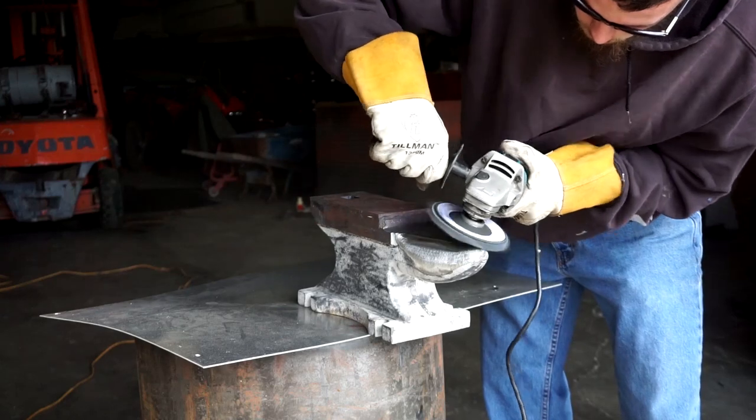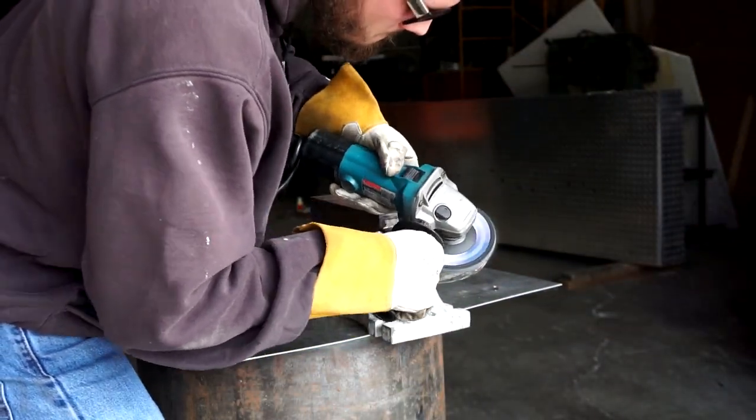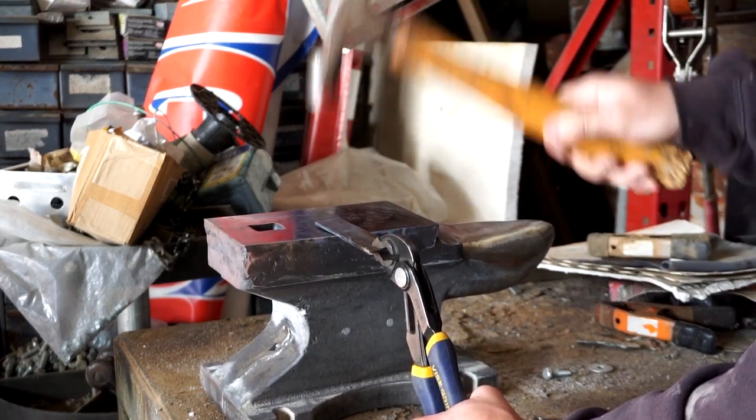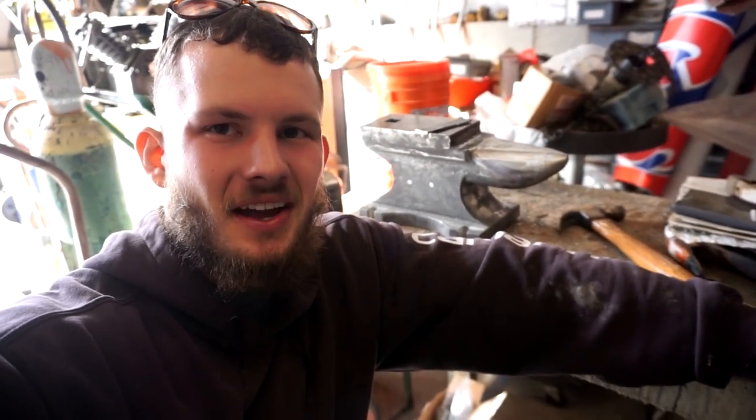That's okay — I plan on following this whole thing up. Eventually I'll get a better setup so I can heat that steel a lot hotter, get it to the proper temperature, and really get that A2 hardened up top. Another thing I plan on doing is welding all the way around the surface of the horn and then grinding it down smooth, keeping some weld on there so it's not cast iron I'm beating on — it's hardened weld. It's not perfect but it'll be better than cast iron. I still need to mount this; right now it's just sitting on a bench — eventually I'll get a wood round and screw it down. Thanks for watching, please subscribe, like, and comment. See you next time.